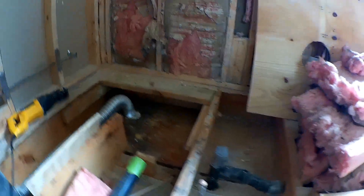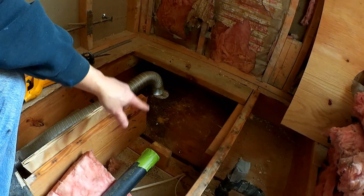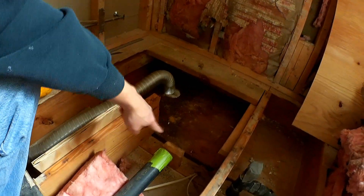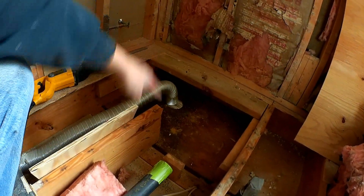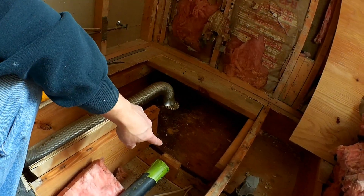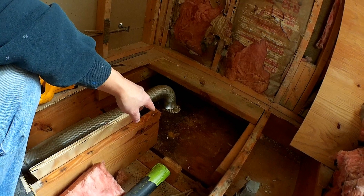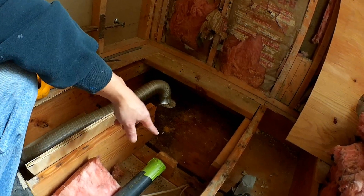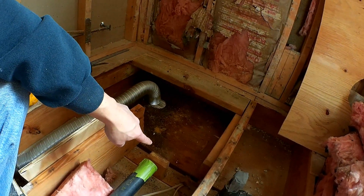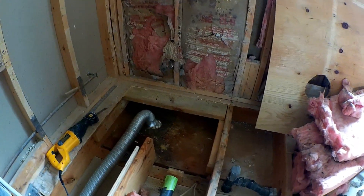You have to consider how much of a floor drop you need, because the fall for the drain has to be a quarter inch per foot. From this point to the far corner is about 29 to 30 inches. At 24 inches I need at least a half inch drop, but at 30 inches I'm going to need probably another quarter inch — so I'm thinking three-quarters of an inch drop from here to there in each direction.